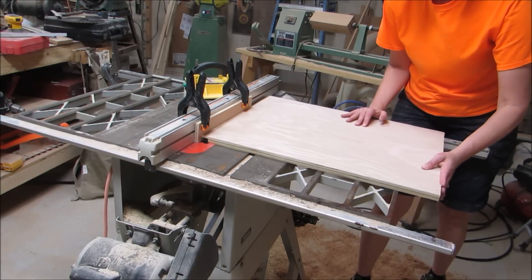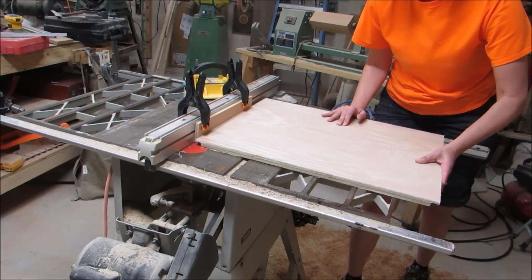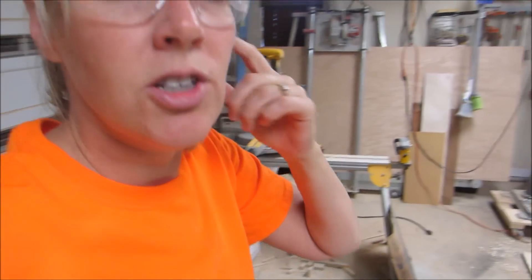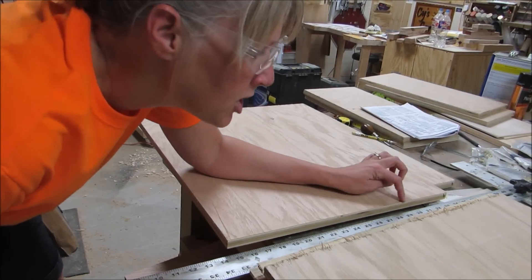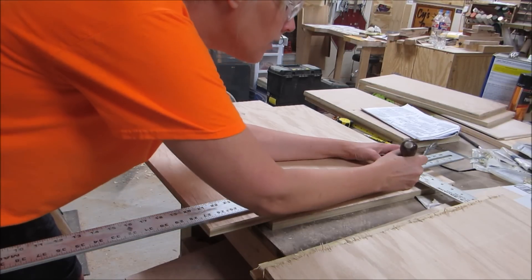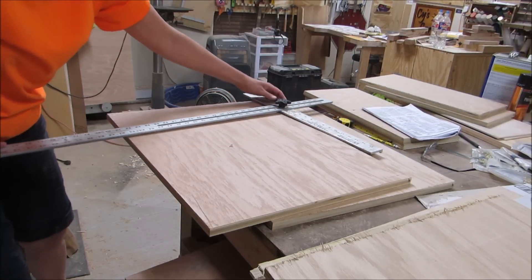I was careful to make sure I was cutting the right side on all the rest of them. I had to do two passes on each because of that short auxiliary board and it wasn't very sturdy toward the end, but it seemed to work. I'd gotten a tip to pre-scribe the line to reduce tear-out, so I measured the three-quarter distance and marked it. I'm game to try it.